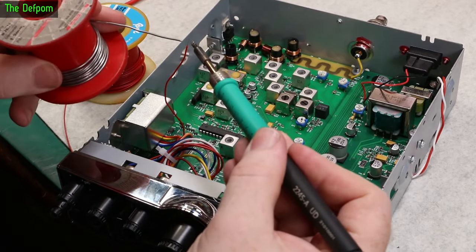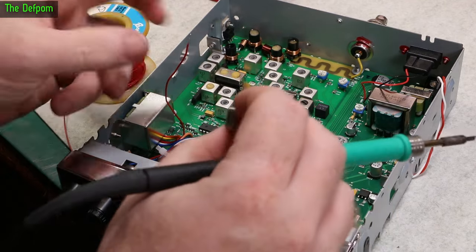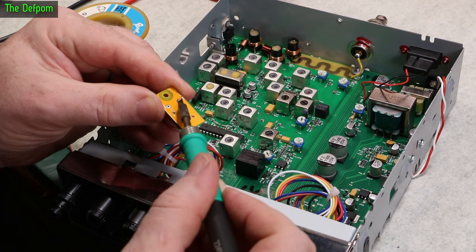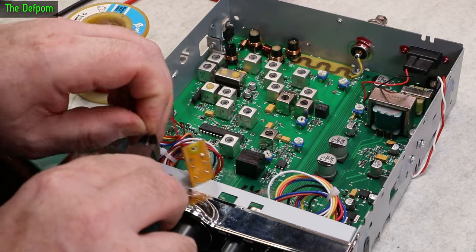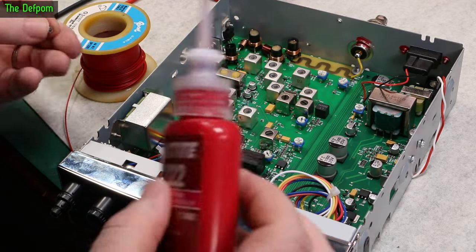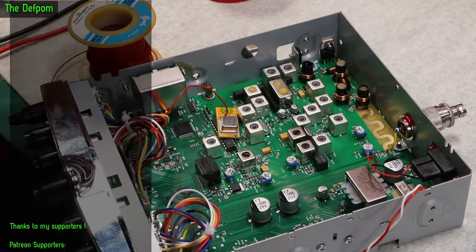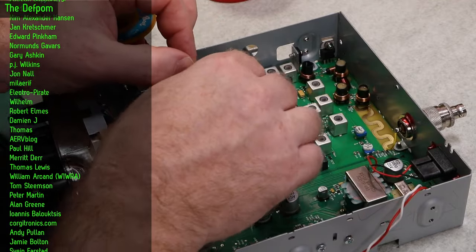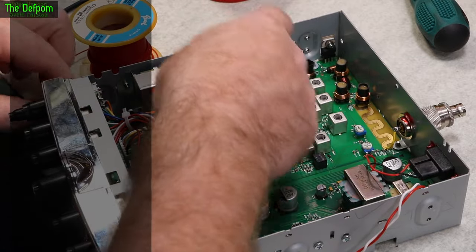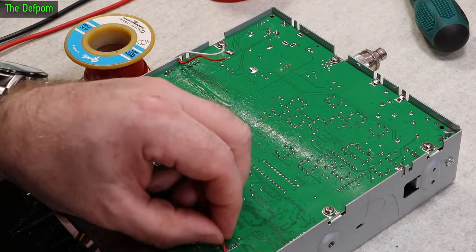Let's just tin this wire. This wire is really thin for what I need — actually way smaller than the holes in the circuit board — but it'll fit through the other hole really easily. Let's shove this under the VCC pin. Trim this off. The output and the other one I'm going to do from the top of the board. So I'm going to attach the board now, do some thread lock on this as well — put a little bit in there, just a little bit. If someone wants to take this out, I want it to be removable. Let's put the screw in there, sit it in there, get it nice and straight. That's in place. So I'll have to do some routing with this wire — get it tidy — pull it through, have a little bit of slack in it, and put it onto that position there.